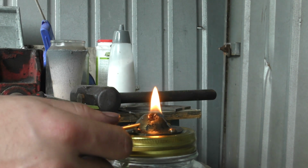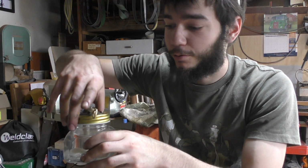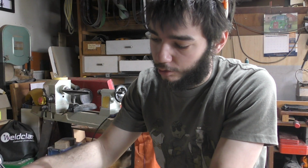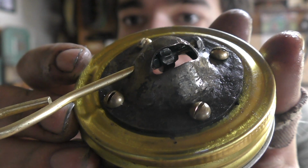That's insane. That actually works. Just the fact that this thing works at all is an absolute amazement to me. There were a few things I had to adjust to get this to work properly. First of all, you'll be able to see that the gear in there is significantly wider. And of course, I've gone back to more of a sprocket or gear shape. It's not just a hexagon, and that really helped to catch onto the fabric of the wick.